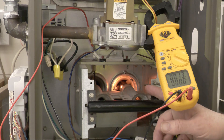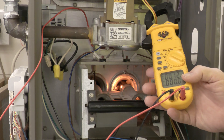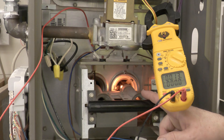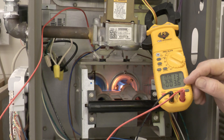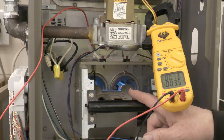So it's heating up right now. We're currently not reading anything — it's right here at the bottom where our microamps are. What we're really shooting for is above two microamps on this flame sensor. The flame sensor is sensing 3.5 microamps, so this flame sensor is good.